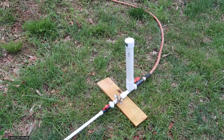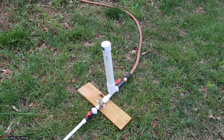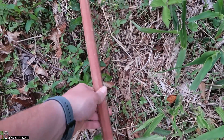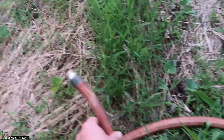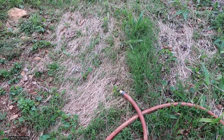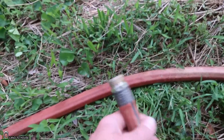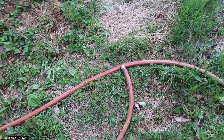After several minutes, I moved it from right here where it had a foot back down to 20 inches because it was taking far too long. So it had made it up to about right here, which was taking forever. So I've moved the hose down to this point here, 20 inches of head pressure. I've let this pump for 30 minutes and I think it has almost filled this garden hose up here to about the 6 to 7 foot mark. It's somewhere right around here. So we've got about a foot more to go. Definitely not pumping very fast.